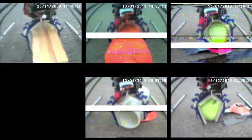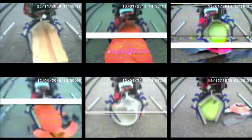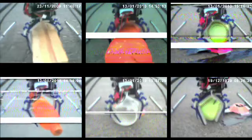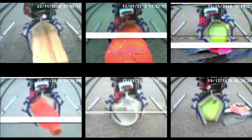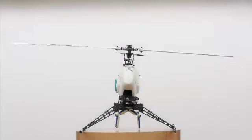Compliance in the gripper also provides benefits to aircraft stability, such that when contacting external objects, the gripper flexes passively, minimizing disturbance forces applied to the airframe. A rigid manipulator could snag on an obstacle and destabilize the aircraft, or lead to unstable closed-loop flight dynamics when coupled to objects on the ground.